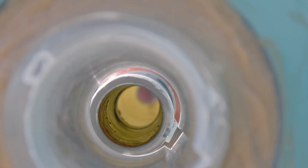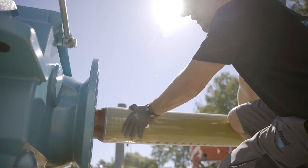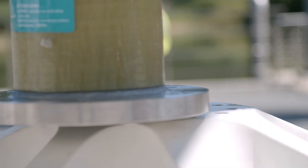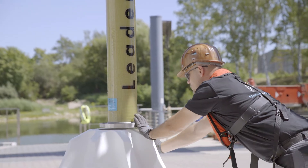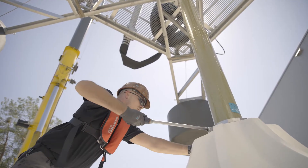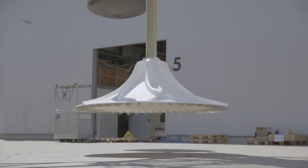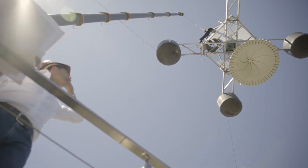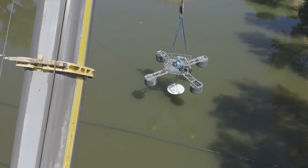The process air is fed directly into the mixer body through our specially designed shaft. It is made of light yet strong fiber reinforced plastic. No other tubes or pipes are necessary. At the mixer body itself, the air is dispersed by shear fins throughout the circumference of the mixer. This way, the oxygen is introduced at the bottom of the lagoon where it needs to be and distributed 360 degrees consistently.